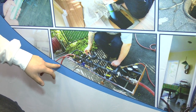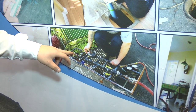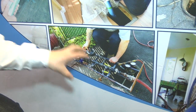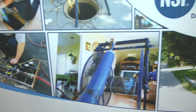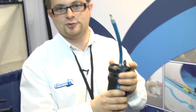That right there is the trailer intake — that's the steam that comes out of the trailer and into the process. The only thing you've got to worry about in the trailer is that red button I showed you. Everything happens here, everything is controlled from here. Once the repair is done, you take that bladder out, and once that bladder is out, you've got a nice new sewer without any excavation.